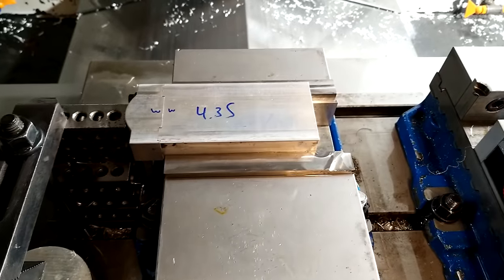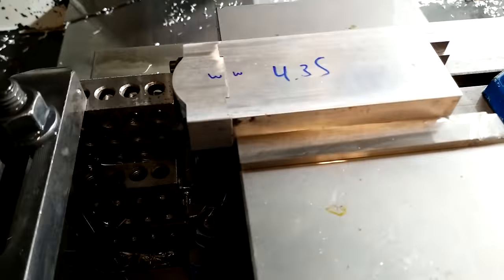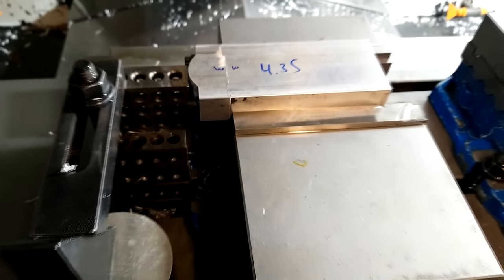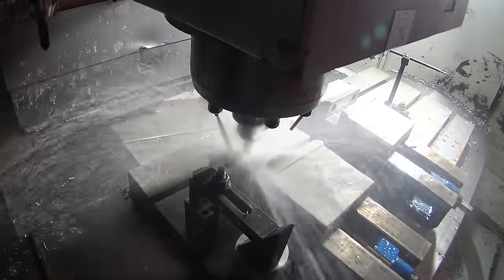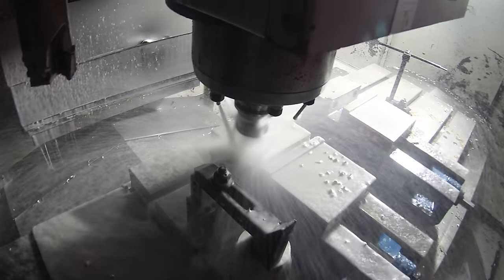I got my first rod mounted on the vise. What I want is to get some of the underside machining done first as I will do all of the finishing mounted on a fixture. I really like to rough my diameter with helical ramping — it's fast and it's one less tool change to do. My machine is an old Carousel model with about 10 to 12 seconds for every tool change, so I try to keep them at a minimum.